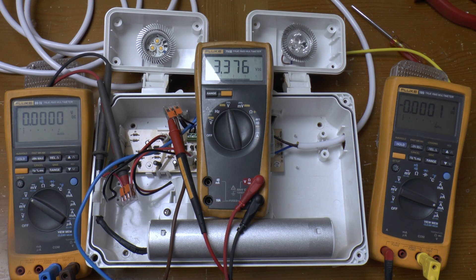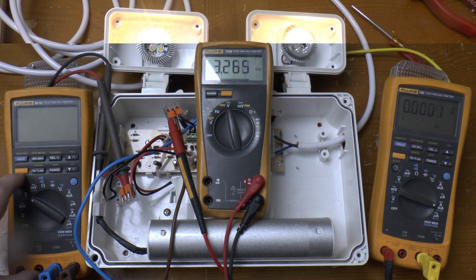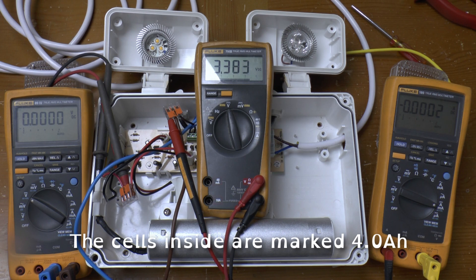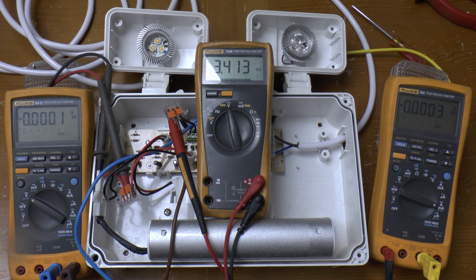So what have we learned? Well, it doesn't sustain 3 watts per fitting — the fitting might be capable of 3 watts but it doesn't actually sustain that. But does it really matter? We can see the brightness difference at the start and end of its run, and off camera I did knock the big light off and there was still plenty of light to see by — it would have done its job. Obviously the battery would last longer since I was only using a 3 amp-hour cell; the proper pack is 6 amp hours, so run time certainly isn't an issue. These meters haven't been calibrated in years, but I did try swapping them over before filming and they gave exactly the same readings between the two — so make of that what you will.